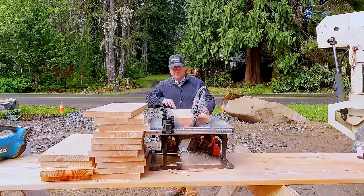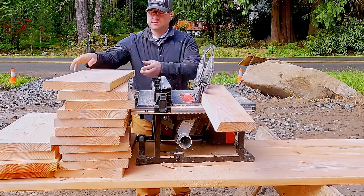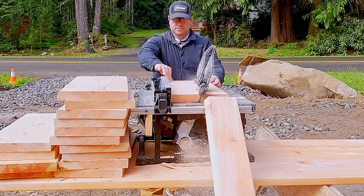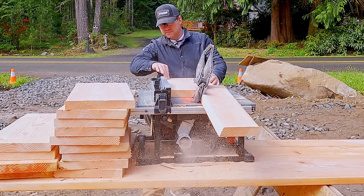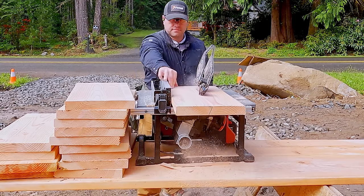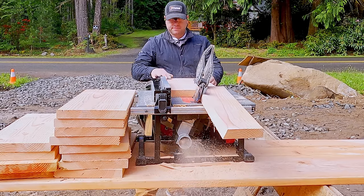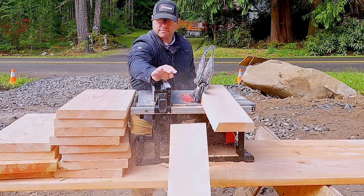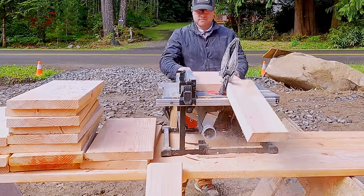This is the little, I believe, 8-and-a-quarter-inch cordless Milwaukee table saw. Since then I've put in a Diablo blade and it rips a whole lot better — I should have done that to begin with, but it did okay; it just overheated the battery. I think this thing works really well even on a 22-and-a-half-degree bevel because it's a 5/12. The riving knife keeps it from binding, and the little anti-kickback does such a great job. Guards can be a hassle, but I've been 99% really impressed with the guard — that 1% irritation is just the price of safety.